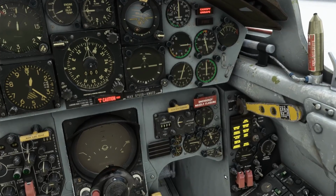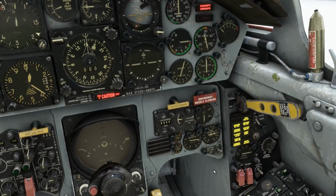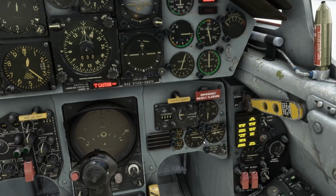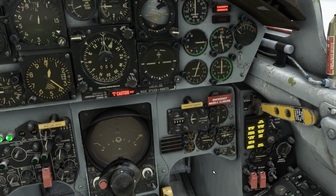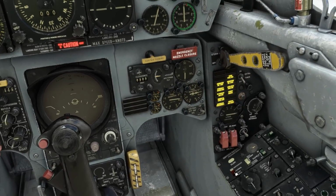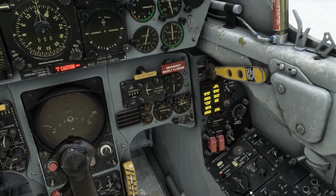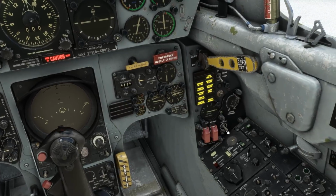So just the tip tanks fitted to the aircraft today, and showing about 1100 pounds there in each of the tip tanks, and we've got around just under 6,000 pounds of fuel on board the aircraft. Generator switches are both on and guarded. Canopy defogger rheostat will leave off for the time being, so we'll carry out a fuel quantity and light test.